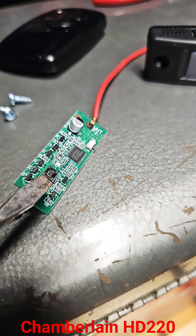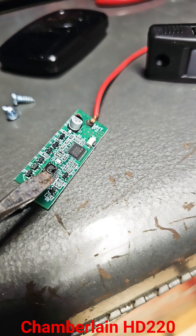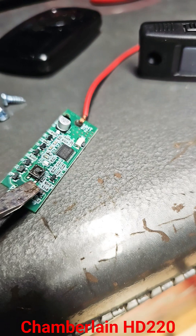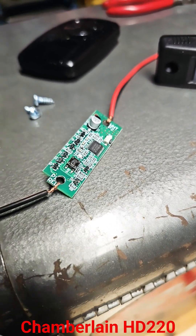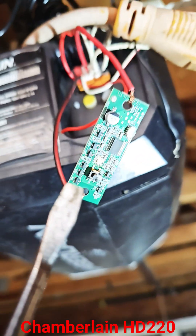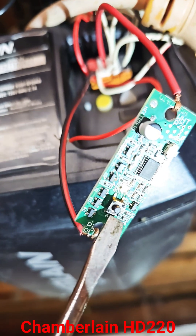So here you have a button right here — once a power supply is hooked up to this little thing and you push the button, it opens the garage door. So I'm trying to tap onto the bottom of these two terminals right here to run some wire out so I can connect it to the device up there. Right now it's connected to the garage door opener — if I touch these terminals through the button, I should trigger it.